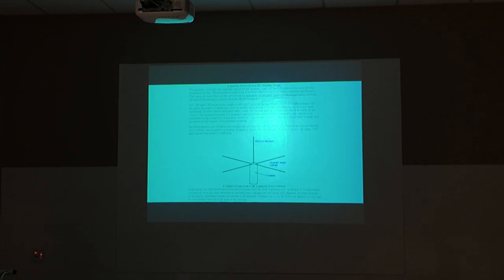If you're measuring a piece of coax and it says this piece of coax needs to be a quarter wavelength, RF wavelength, well, you have to know the velocity factor of that coax. Because if you mathematically say, I need a quarter wavelength at this frequency, on 20 meters it's going to be 16 feet something. But if you make it out of coax, and that coax has a velocity factor of 0.66, then you have to multiply that physical length by 0.66 to get the RF length, and it'll be shorter.